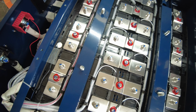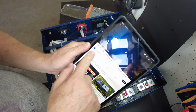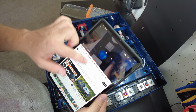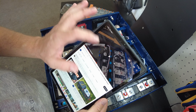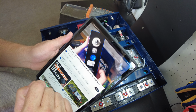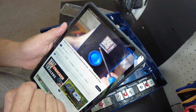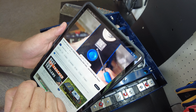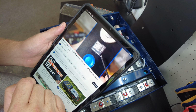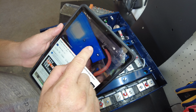So yeah, really nice. Okay, so I've looked these up, and Lithium Solar also did a review. I'll link his review as well in the description. And he says these are Eve cells. They are Eve, I think they're LF100LA. So here is the QR code. You can see it starts with 04Q, which is typical of an Eve cell. It appears to be the original QR code. I don't see any sanding or polishing or anything that looks suspicious. And it says here 320 watt hours. So these are 100 amp hour cells.